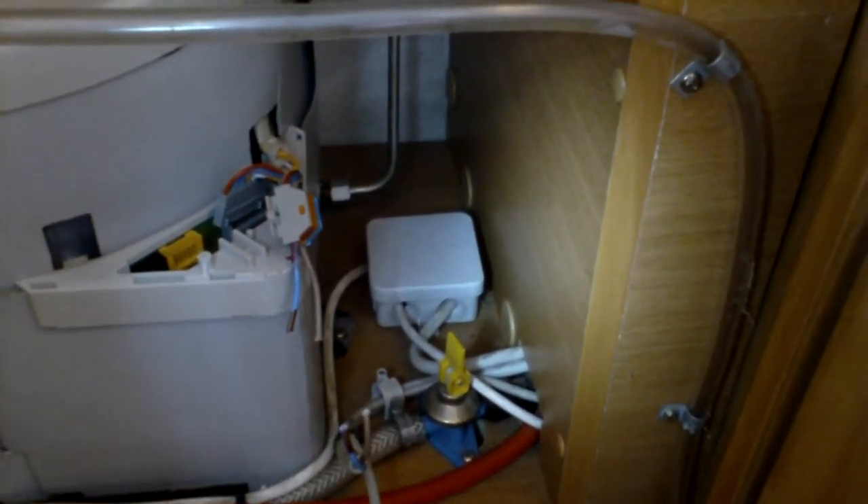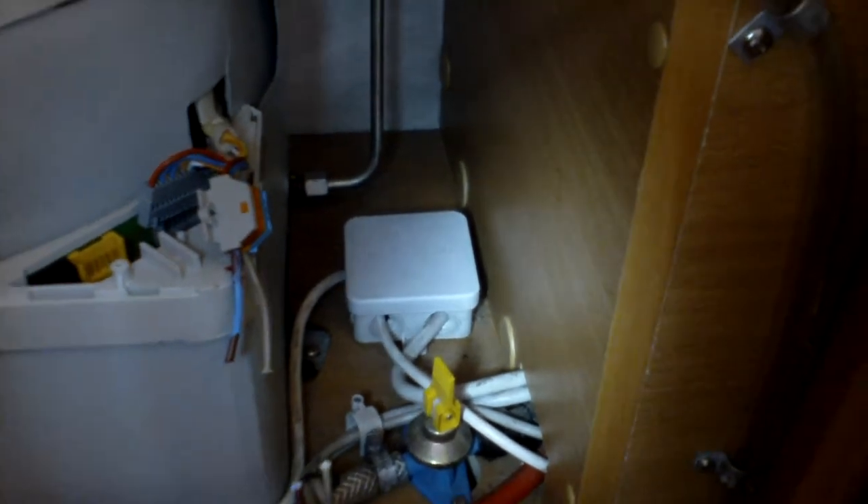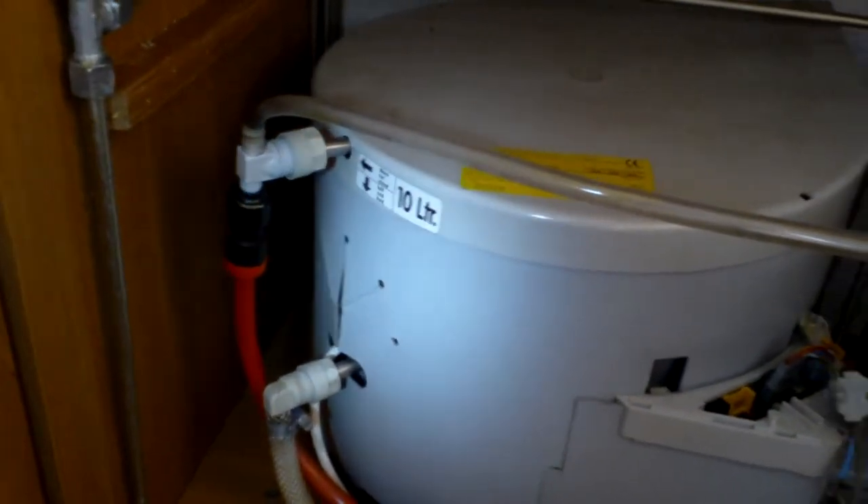Next job: there's a wire here that goes all the way around to this unit here. I'm sorry it's so dark, but it's where you have to work. I've got to get that cover off and disconnect it there, because that is where the mains for the water heater goes. Once I've got a bit of light - you can see the little box I've got to get to, with the wire coming from the element. The white wire comes down round the bottom of the unit to this connector box. So once I do that, I've only got the gas to remove and the pipes.